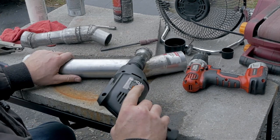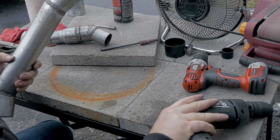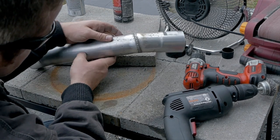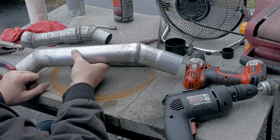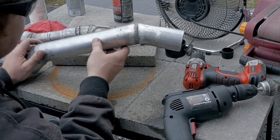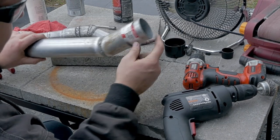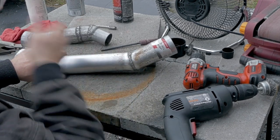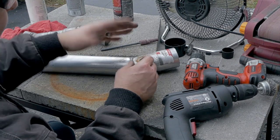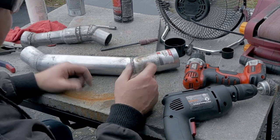Our finished garbage is now done. Let's clean it up and see how it looks. That looks like crap, but you know, each spot is definitely solid. Now it's time to make it look like this other end. The downside of flux core — you can get a good weld, but it's sure not going to be the prettiest weld, especially on thin stuff like this. On thicker metal, like the kind from Lowe's with that anti-rust coating, you don't get nearly as much spatter. But there's nothing on this pipe to prevent spatter from sticking, so this is where cleanup comes in.